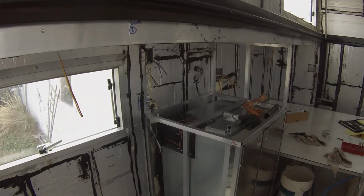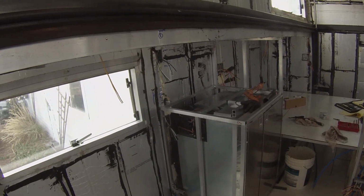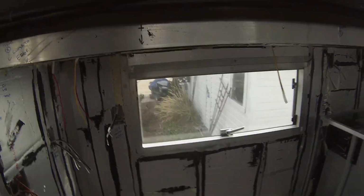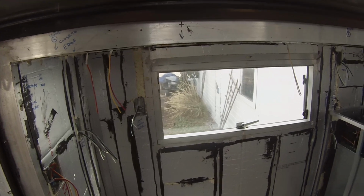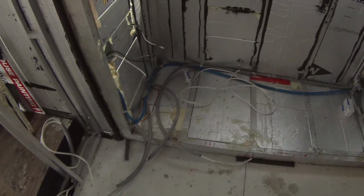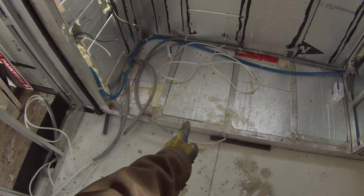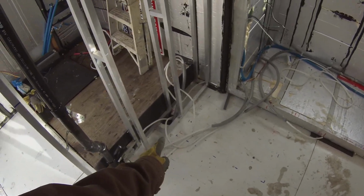So I'm bumping the kitchen counter 4 inches out and cabinets 4 inches out. And I also have to accommodate for the window trim, which is going to be about 1.5-2 inches out from that, which is at the exact height of the countertop. So I've got to figure that out, bump this out, and then if you look down here, the kitchen profile goes from here to there and then bumps out for the cooktops to there, goes to there and then back.